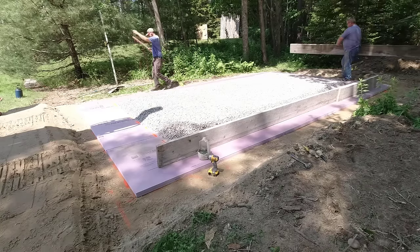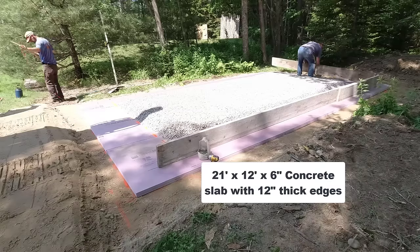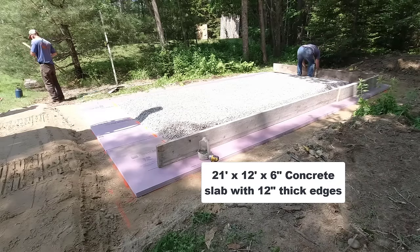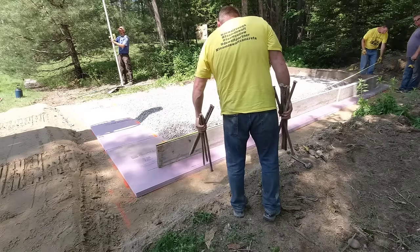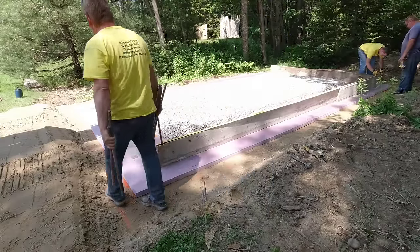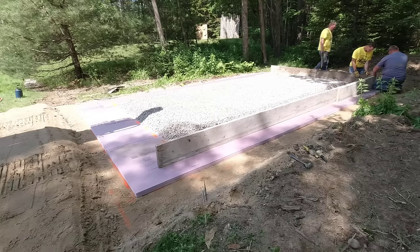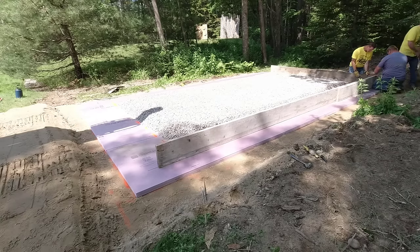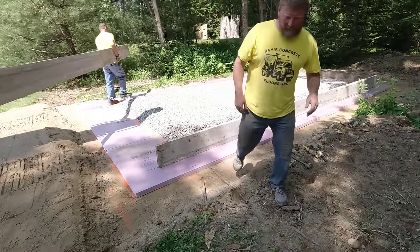What we got here is a 21-foot by 12-foot garage slab. The excavator came in and grubbed out the original soil, dug that down about 18 inches, then brought in the base gravel — that's what you see under the styrofoam. He brought in about 18 inches of base gravel, compacted it, leveled it really nice, and then put two inches of styrofoam over that, bigger than the slab.